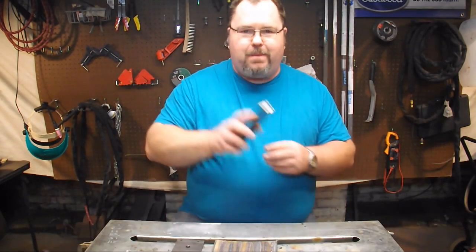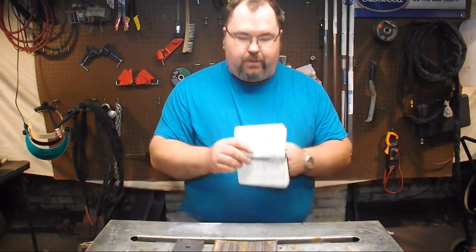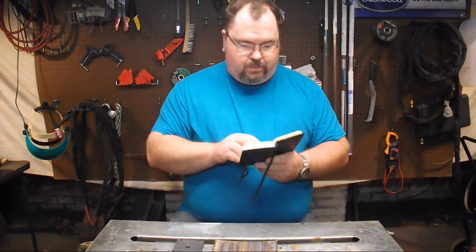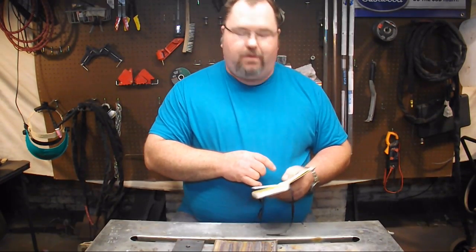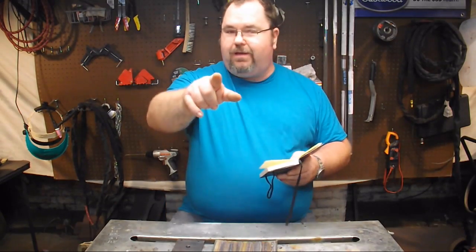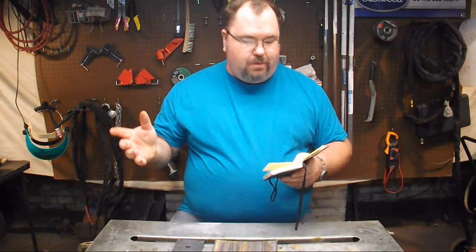What are the differences? Well, for that we're going to get out my handy notebook — you have a handy notebook, don't you? — where you keep all of your pertinent information. You should. Stainless steel has 0.08% carbon. 1018 steel has — guess it — 0.18% carbon.